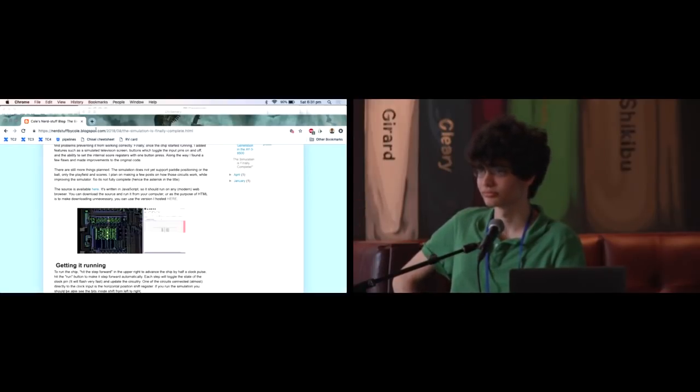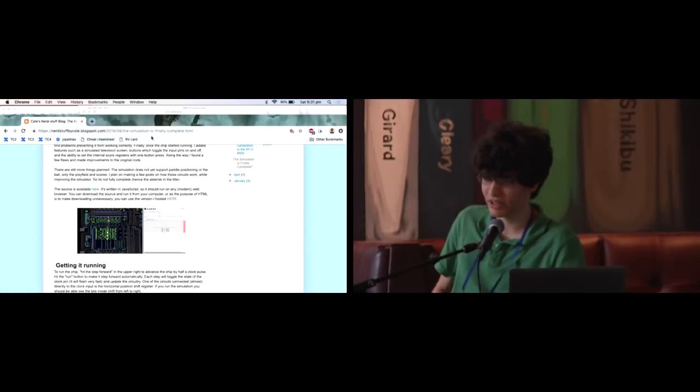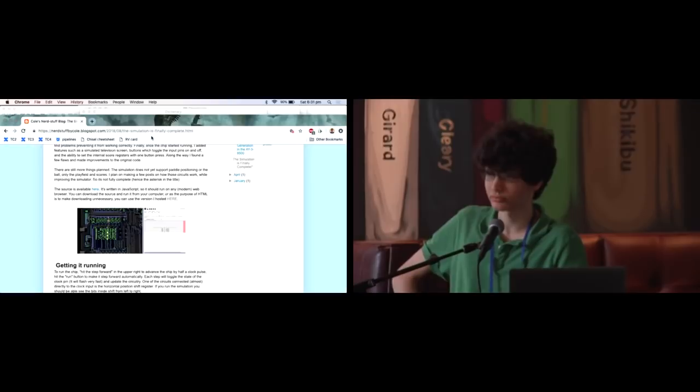What's the smallest feature size that you think you could reverse engineer in this manner? Well, there is actually a Russian team that's trying this with the PlayStation 1 chips. The advantage is they're standard cells. These chips were laid out by hand, before standard cells came out. And with standard cells, you can actually use computer vision to identify them. I don't think they've tried converting them to Verilog, but hey, maybe in 50 years people will be doing it with modern chips. But otherwise, it gets very hard after the mid-80s. Cool, thanks.